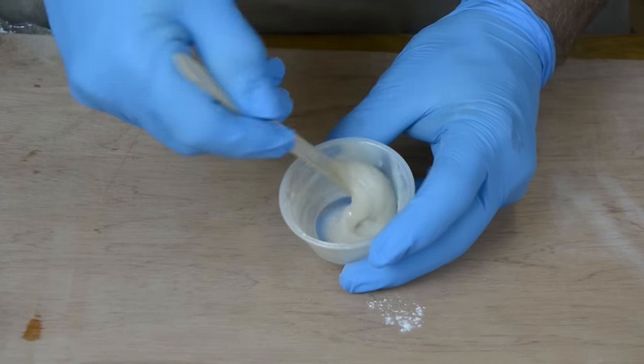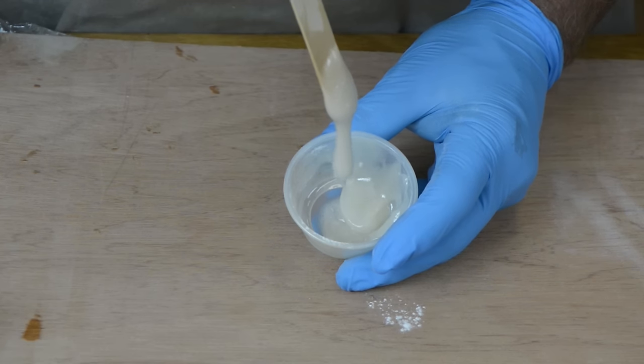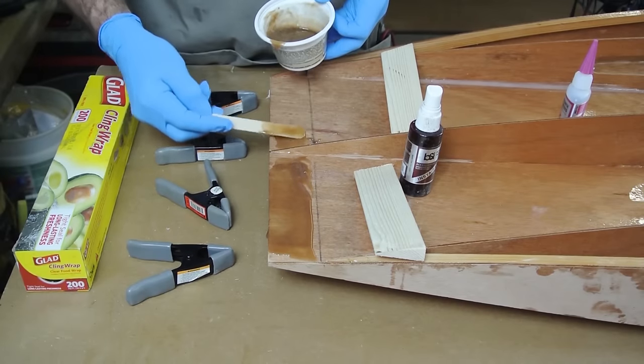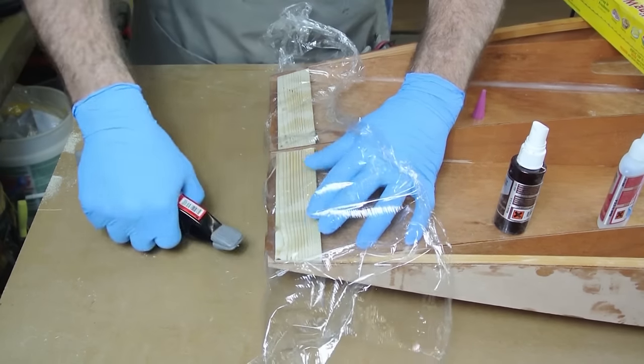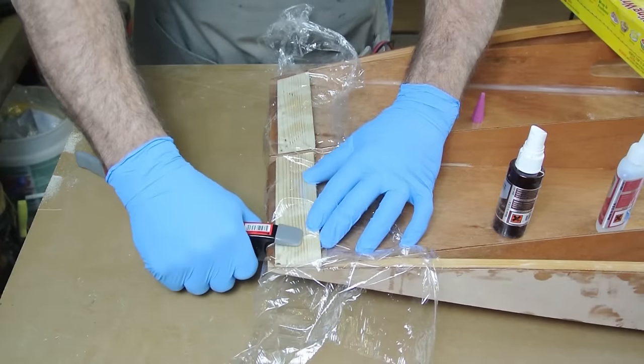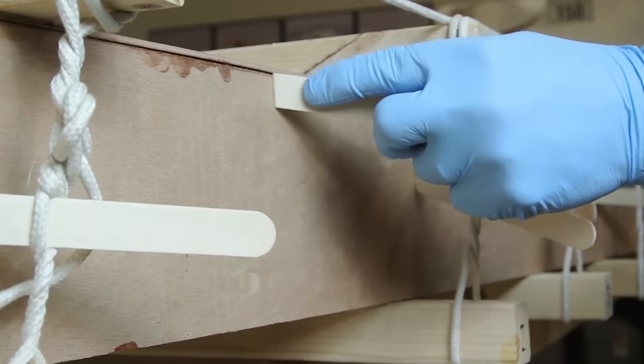Epoxy can also be used to bond or laminate wood. For most applications, you will want to use thickened epoxy. Thicken the epoxy until it has reached a yogurt-like consistency — this will ensure the epoxy stays in the joint and is not completely absorbed by the wood. Once your epoxy is thickened, spread it evenly on one or, if possible, both faces of the joint. Completely cover the bonding surface. It is better to apply a thick layer and let it squeeze out of the joint rather than apply too little. Align the pieces and clamp them in place, making sure to cover your clamps and blocks to prevent gluing them to your work. Once the pieces are clamped, use a rag or scraper to clean up the epoxy that squeezed out of the joint, which will minimize the time required to later sand and finish the pieces.